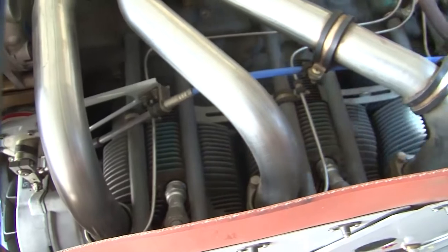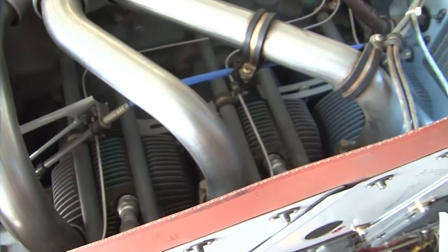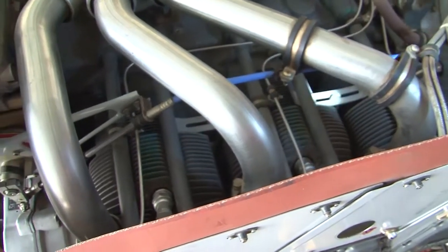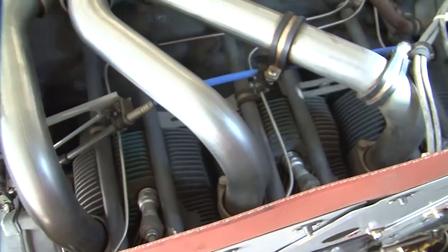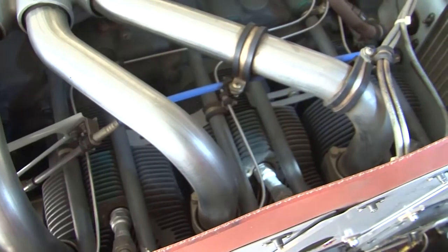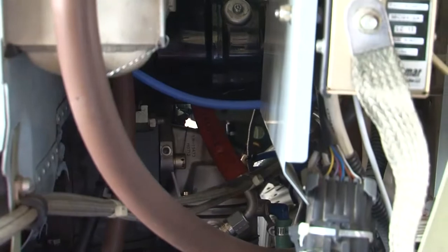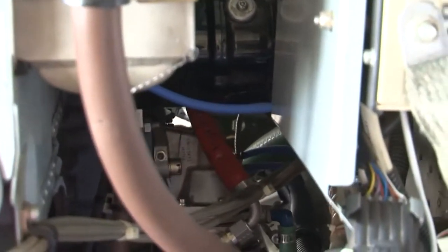It is a daily inspection schedule, and they are all visual checks. We are inspecting visually that the fins are free of cracks. Similarly, we will inspect the other three cylinders also for the fins, which should be free of cracks and other damages. Next inspection is inspect magnetos for security of attachments.